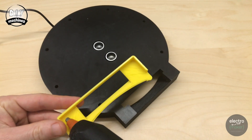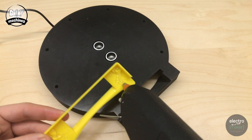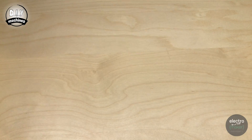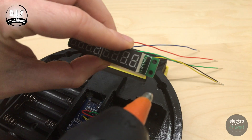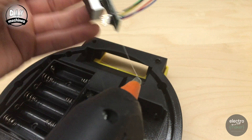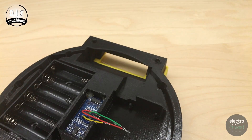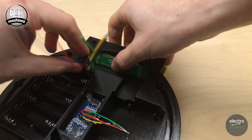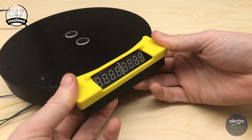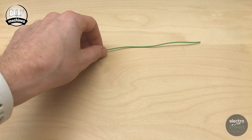Attach the shield for the display with some hot melt glue. Don't put too much here, otherwise when you push it up against the main base you'll have a little bit ooze out. Add some glue to each of the corners of the display and pop it into place from behind. Make sure that when you glue it in, when you look at it from the front, the decimal places are at the bottom of the display.